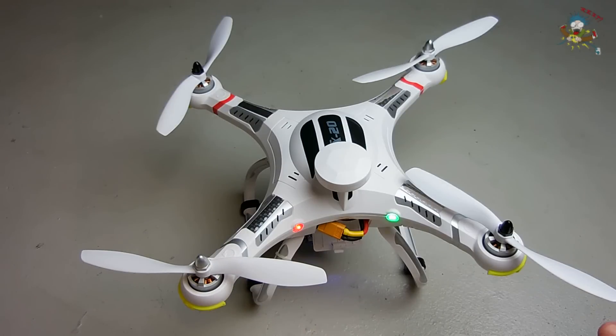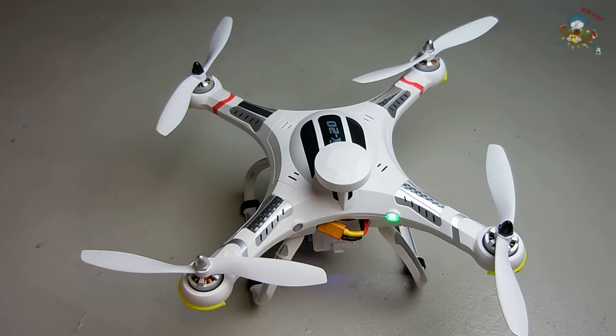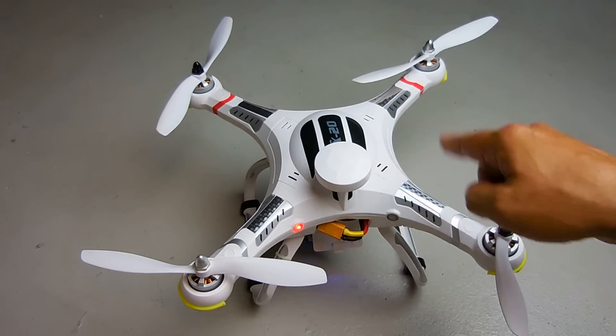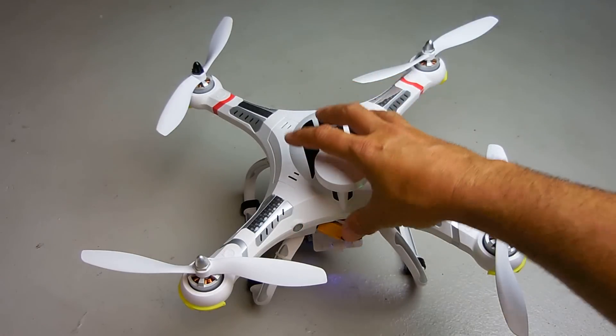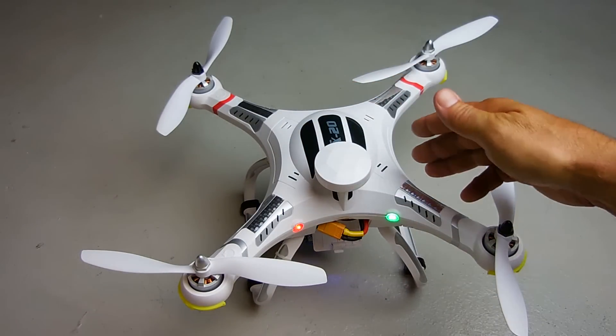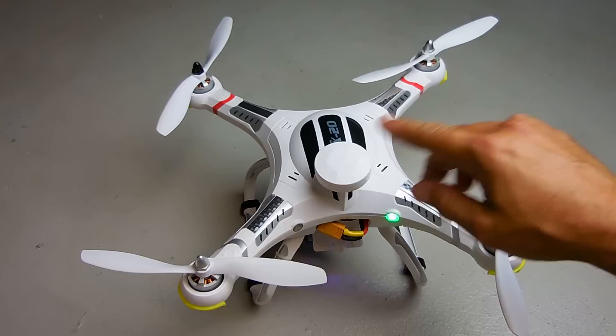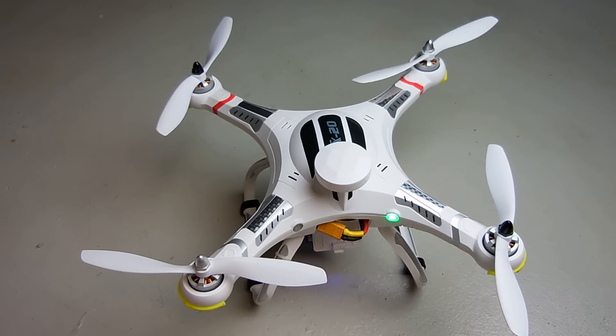As you saw, this one does not power up. I'm going to take apart the unit and show you exactly what you have to do to fix this problem. You're going to have to remove the props and disassemble the entire top of the unit to access the electronic speed control board — the ESC board. There are two green ones and two red ones installed on this unit.